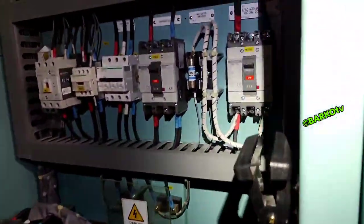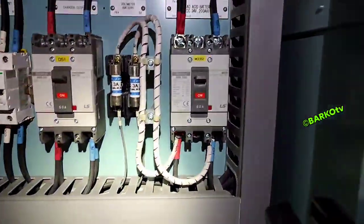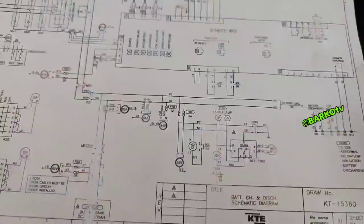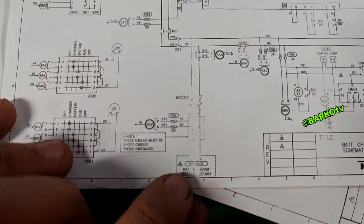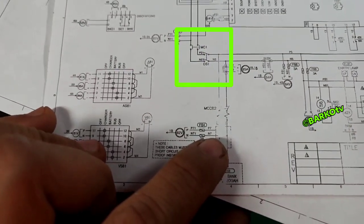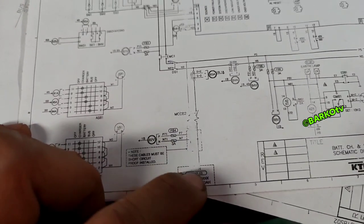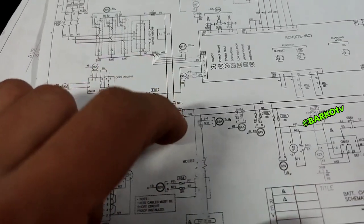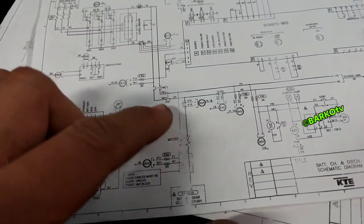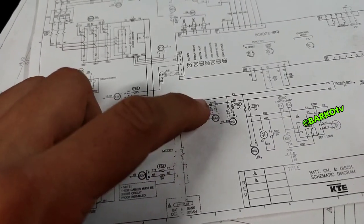That's it. If you replace the batteries without interruption, turn off that breaker MCCB2. If you have trouble with the charger, just turn off MCB1 — that is for the charger — and there will be no interruption, because there is battery supply going to the 24-volt distribution for the ship's 24 volts. That's it: MCB1 and MCCB2.